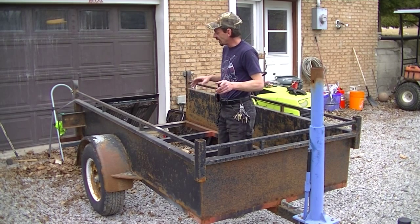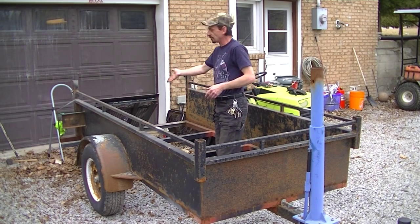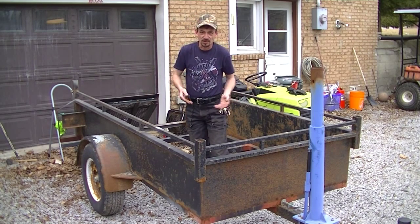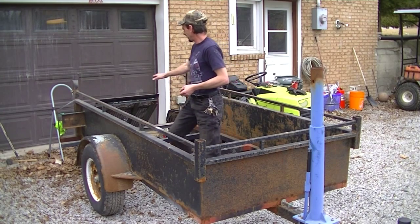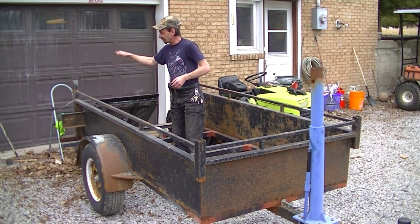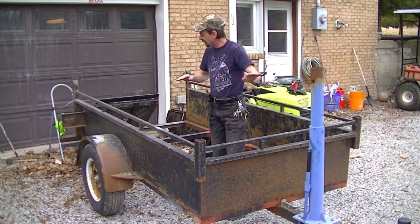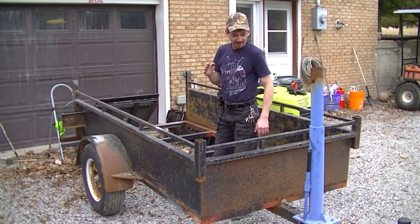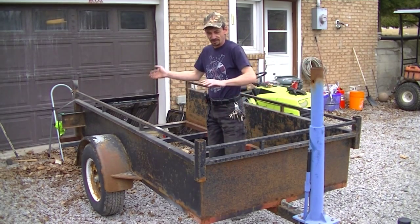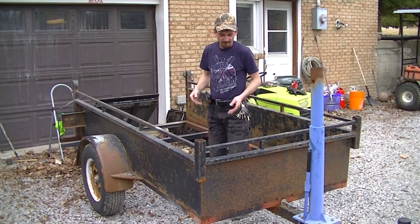Now, you're asking me: how are you going to get that tractor up and down reasonably easily when clearly the ramps are only so long? Well, for those of you that have been paying attention, that's where the tilt and load really shines. I'm going to make it so I can remove these gates from the rear in their normal resting positions and pin them to this upper hoop, so they're in place. And then when I tilt the trailer, that's going to give me ramps to the upper level and put everything on enough of an angle that I don't have a ridiculous ramp angle. Then I can use this crane — because it's got a winch on it — to bring the load up onto the upper level and secure it. Then I can drop the trailer back down, put the ramps back where they belong, strap everything down, and away I go.